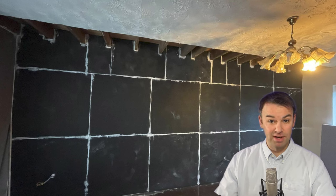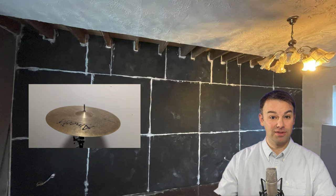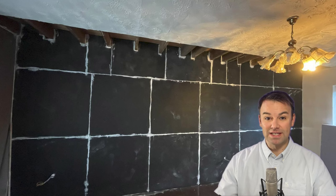Start sound dampening the wall, cover the entire wall, and create that air tightness by tucking the rubber up all the way around the joists. It really doesn't matter what it looks like — just make sure you seal it all up. Think of your wall as a ringing drum cymbal; by coating it in that rubber the wall will not resonate anymore, so you won't channel the noise up into other areas of your property.